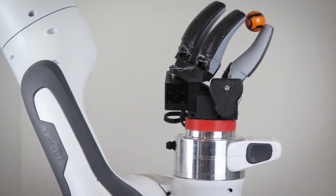Cameras used in tactile sensors are limited by their size, the focal distance of their lenses, and their viewing angles. Therefore, these tactile sensors tend to be small and flat, which confines them to a robot's fingertips. With a longer sensing area, one that more closely resembles a human finger, the camera would need to sit farther from the sensing surface to see the entire area. This is particularly challenging due to size and shape restrictions of a robotic gripper.